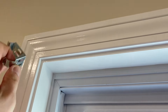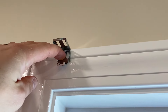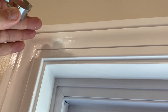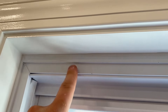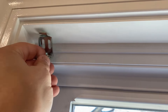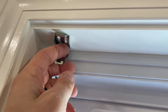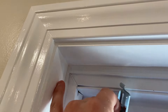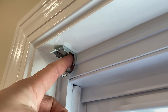If you're putting them on the outside — say you had a trimless window, or even if you have trim — you would want to install them something like this. Doing it this way is going to make them pretty much tight to the top. On the inside it doesn't really matter where you put them. I'm going to put them about an inch away from the sides on both sides, just to make them even and hold them tight to the window.